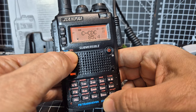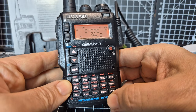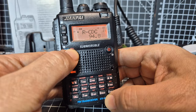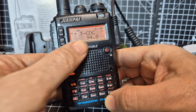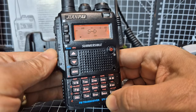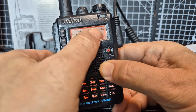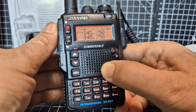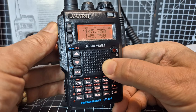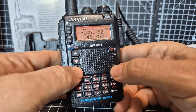I'll work out if there's a quicker way. There's the tone - go menu and we want 94.8. Enter. And then we want a minus shift. Menu - code, decode, encode. There it is - encode, that's the one we wanted. Shift - menu, minus, enter. We back out - that should be our repeater. We've got a minus written there. I was pressing the wrong PTT! PTT for the A and the B band. Yeah, I'll get outside and I will do some tests soon.